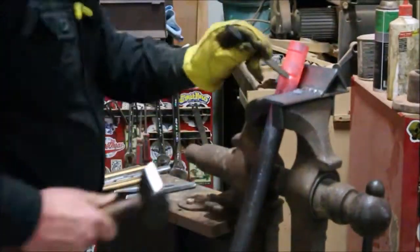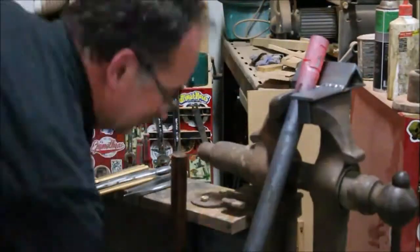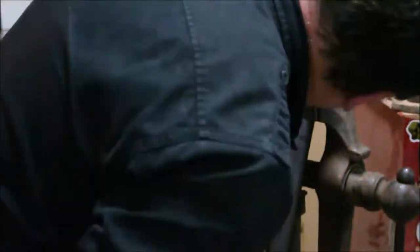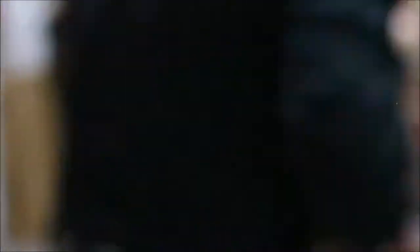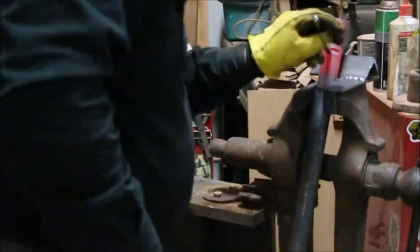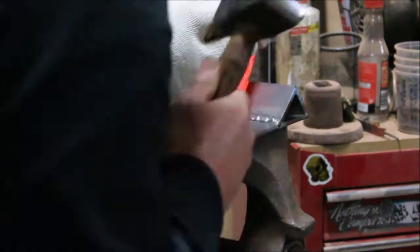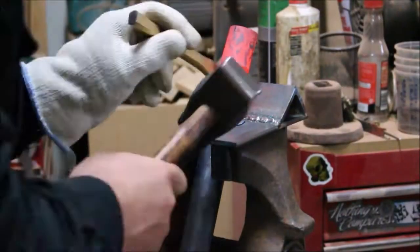These sculptural projects require that you manage your heat as well as possible to maintain the efficiency. While it's bright orange you can do your really, really deep forging, and as it cools off you can do planishing and tidying up work.